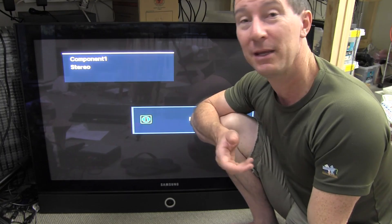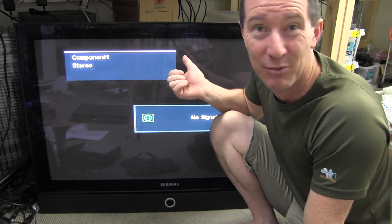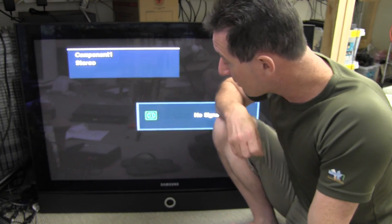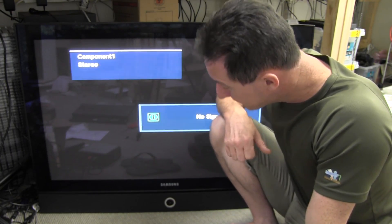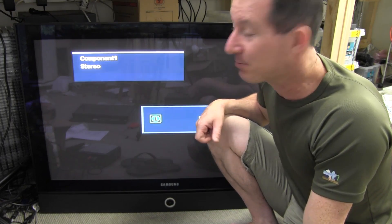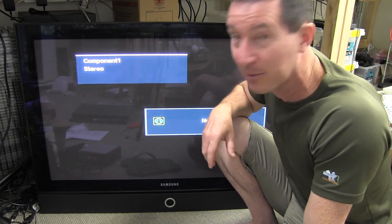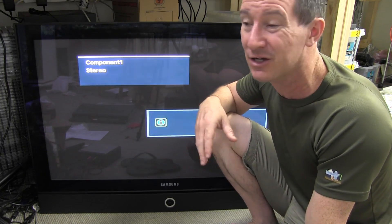Trevor from the Television Mag Forum commented that I should probably do a factory reset in the service menu on this thing. But I don't have the service cable that plugs in the back of it, couldn't be bothered making one up, and don't know how it works. From what I'm reading, you can enter the service mode via the remote control — but I don't have a remote for it. I will probably go out and get a remote now because it does seem to work, at least in HDMI mode. If you've got any ideas what's actually going on with this sucker, I'm sure it's something to do with that main decoder chipset. The freezer spray didn't seem to do anything — I expected something to happen there. I need a remote to do the factory reset. Maybe that'll help. Maybe there's nothing physically hardware wrong with it — maybe it just needs a factory reset, the I2C codes going into that decoder chip or something.